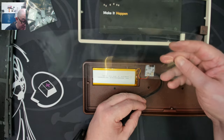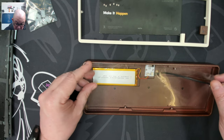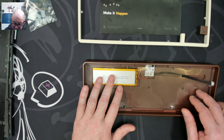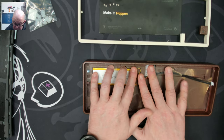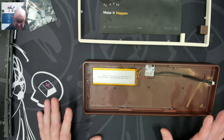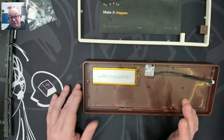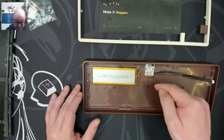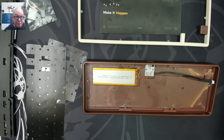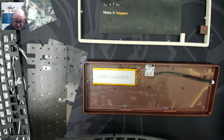All right, first things first, we're gonna put the under PET layer. And this basically helps with that hi-fi layer. Like, it works just with the two above the PCB, but I found that adding a layer of PET below not only prevents any sort of shocks that might happen, but it's not gonna really be the case because of all the foam that we have. But this prevents any conductive contact between the PCB and the plate. It also probably helps to deflect and create more of a chamber in there. I'm kind of just guessing at why that helps, from the little bit I do know.